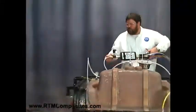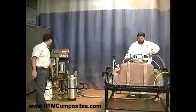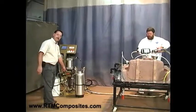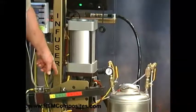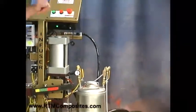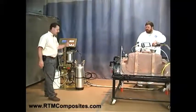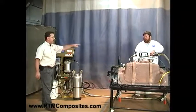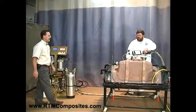The catalyst system is going back to home. The starting point for the catalyst is 1.4%, so the catalyst pump is moving out automatically to 1.4%. Now it will recirculate the small bit of resin in the hose to confirm it's up to temperature. When it senses it's up to temperature, it will stop and automatically begin. In this case, it was right up to temperature to start with, so it's already begun the injection.